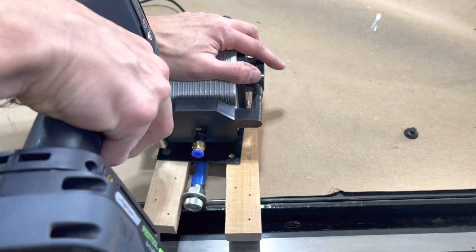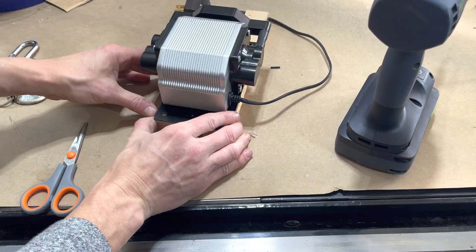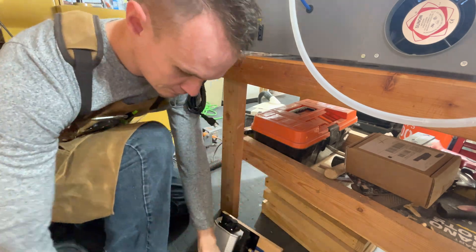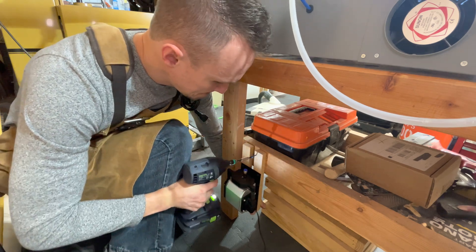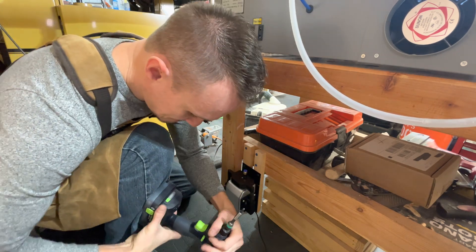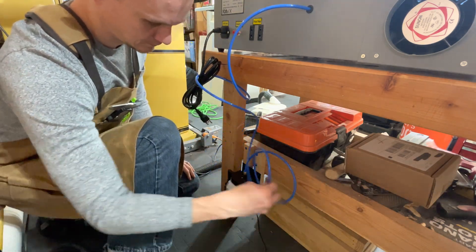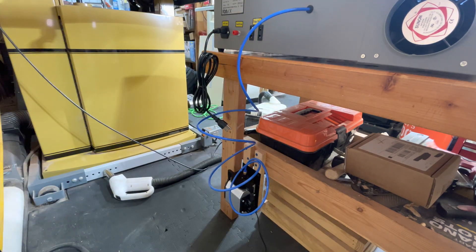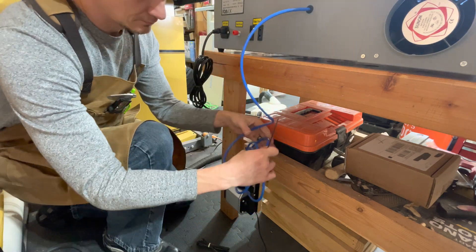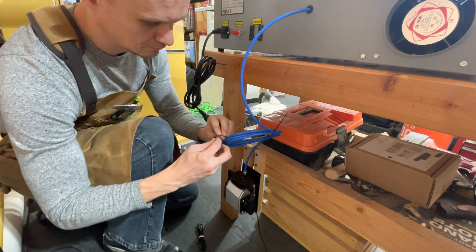I secured the pump to pieces of wood because of that awkward little air inlet tube at the bottom — this made it much easier to attach to the table. I'm using Kreg screws here with flat top washers and they work really well. The mounting location I've chosen has the little air inlet pointed up instead of down, which prevents dust from getting sucked in. If you plan on using this laser a lot or doing heavy cutting, I'd encourage upgrading to an actual air compressor — it gives much more air volume, lets you dial in the flow, and provides a steady stream instead of little puffs from an aquarium pump.